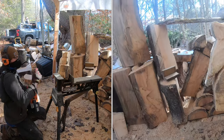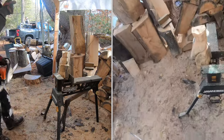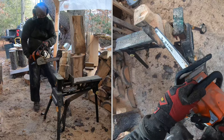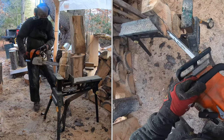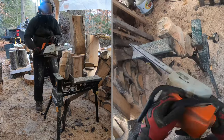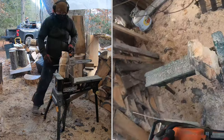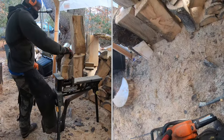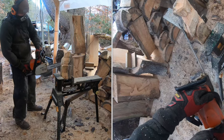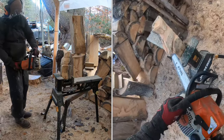If you're carving hardwood, expect more kickback and issues. If you're carving softwood — pines, even poplar — it carves nice but can still give you some kicking around. People ask about spruce — I'll carve it if that's what I have, but it has a lot of sap pockets. As a beginner, carve what you can get. Carving softwoods you don't have to sharpen as much; carving hardwoods you'll have to sharpen a lot more often. Here we're cutting off some angles in the back to round off the back of the head. A lot of our cuts make a wedge or triangular shape — that's how you start to get rounded edges. Think triangular and wedge shapes as you cut and remove pieces.